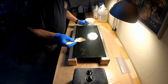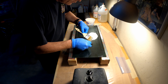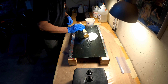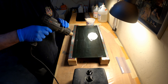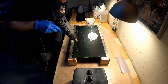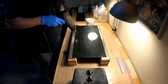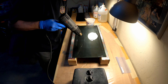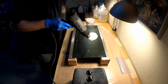Be careful watching for brush hairs — I use cheap brushes. Keep a toothpick around for just that occasion. One hair off, and I believe that's the only one. If you don't like the bubbles that are in there, just go over it quickly with a heat gun, because inevitably you will stir bubbles in. This is the surface that people are going to look at. What you do is heat the resin up — the bubbles will migrate to the surface and pop because you're breaking the surface tension.